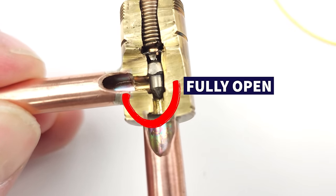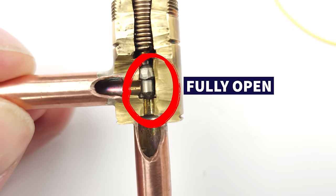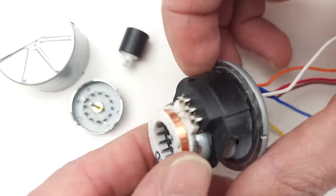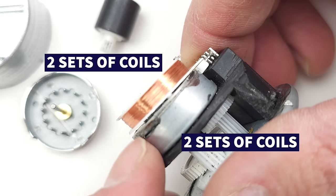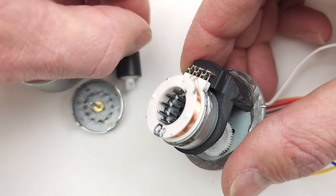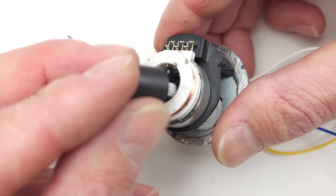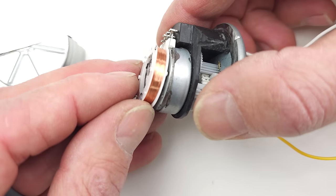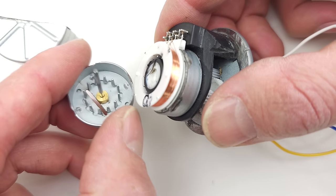This is the fully open position — it doesn't get any more open than this, and then it just pushes down from there. It's very important to know there is no circuit board in here at all. It's just two sets of coils in this upper section and two sets of coils down below. There are iron teeth on the inside. Here you can see the magnet with the gearing, and it moves due to the magnetic field being applied by the coil.